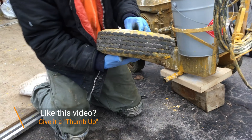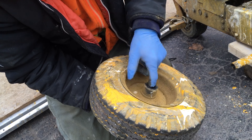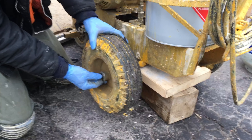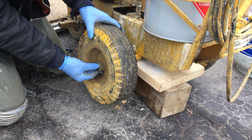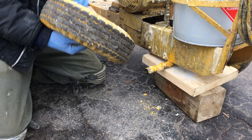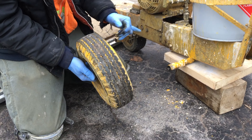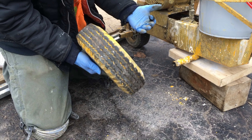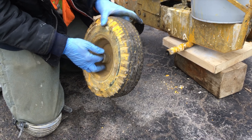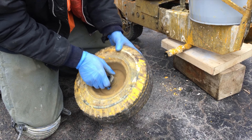What's going on here is the bearings are gone, so there's a lot of play. You can tell with any piece of equipment — when you have your wheel on and the bearings are gone, the tire will be wobbling. That wobble shows the bearings have too much play and need to be replaced. On this machine it's hard to keep the line painter straight if your tires are wobbling, so the bearings have to be changed — and they're completely gone.